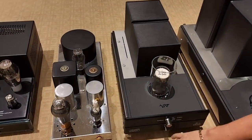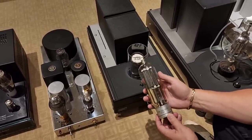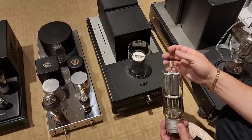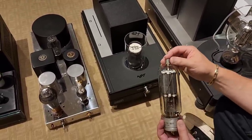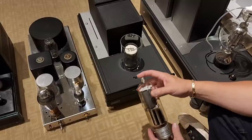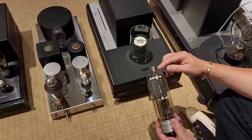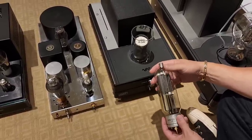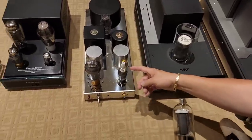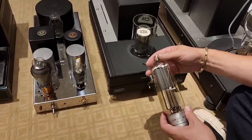Now we're stepping up from 300B to something in the 800-series of tubes. This is an 805 — made in America, new old stock probably from the 1950s. This is a directly heated triode, where you put an electrode on top with a wire that feeds voltage through the top — an older way of heating the tube. The 805 developed into the 845, which you can identify because it lost that nipple on top and did everything through the bottom. So anytime you see a vacuum tube with a wire coming up top, it's directly heated — that's what that cap on top means.